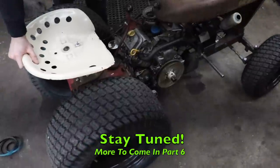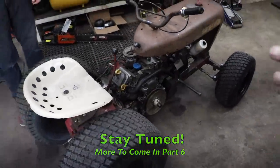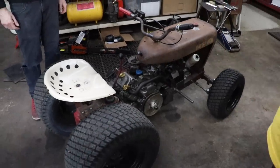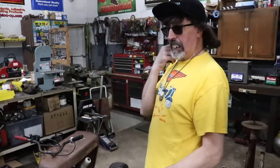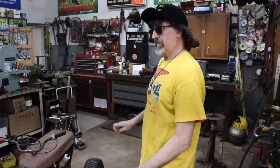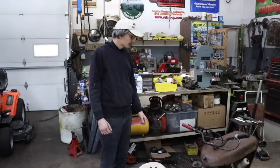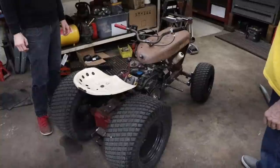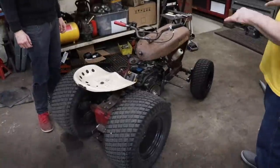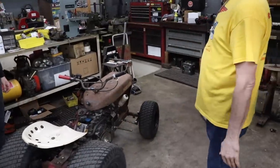So we still got a lot of stuff to do before we tear it down and paint it. But at least the brakes work good. Yeah, that was pretty important. You seen when I was going real fast on that one and I locked up them brakes and that thing was hopping and bopping around. Steering's not all squirrely either at high speed. Yeah. It's pretty solid. Yep. So those little modifications that we were told worked. Kicking them back 20 degrees and toeing it out a little bit.